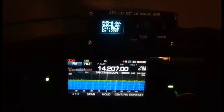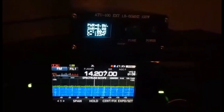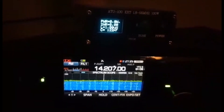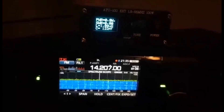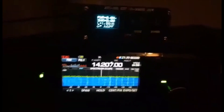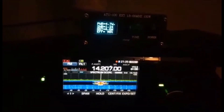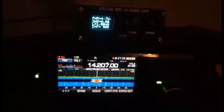These are just software or EEPROM changes made with the PICkit, which cost about £16. I haven't changed the windings at all. You can now use your ATU-100 on your QRP radio. When I key, it says 4.8 watts on a 5-watt radio, and the SWR is good. That's the result.